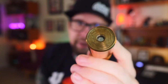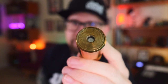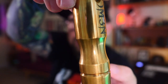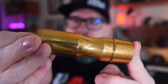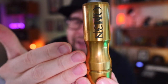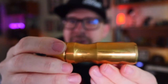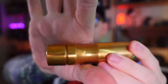That's a hybrid 510 connection, which means your atomizer is going to be directly touching the battery — so it is critical that you have an atomizer with a very nicely protruding positive 510 pin. I've been using this so much it's become fairly tarnished and dull, but right out of the box it looked beautiful — just like a shiny trumpet. You can easily take some Brasso to polish it up. It's just big and brass and thick — super thick brass.